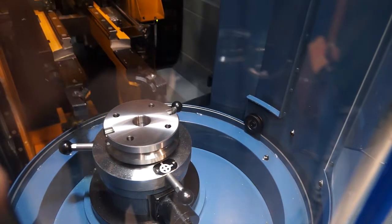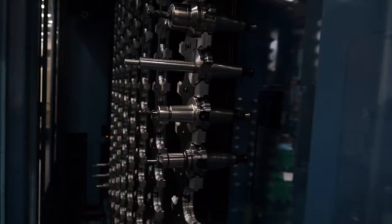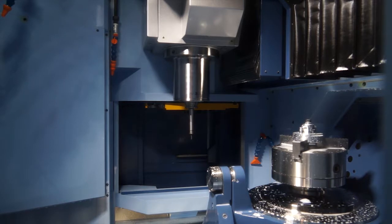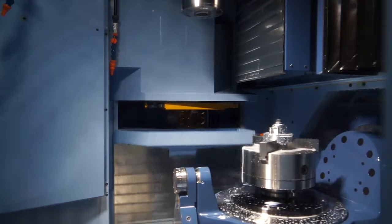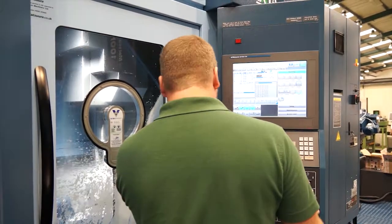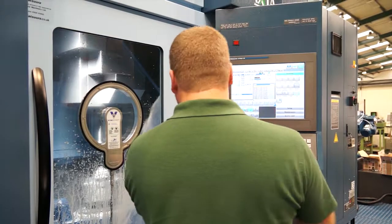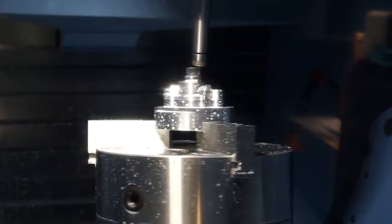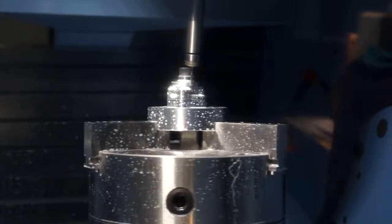Because what I didn't mention is this is a 5-axis machining centre, and when you talk about pallets, you can literally have an operator press the button and produce 32 parts all the same without any intervention. Ideally, that would be great. It doesn't always happen, of course, but the intention is that we can set up a machine once and leave it running. So there's a very definitive line between the H100, that's for your castings, your casings for the transmission or the gearboxes, and here you've got more of the internal parts. Yeah, that's correct. The 100H gives us great flexibility in terms of castings and all the internals that we can manufacture on here.